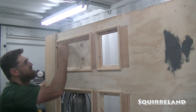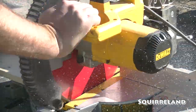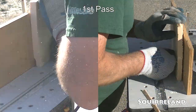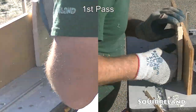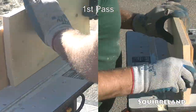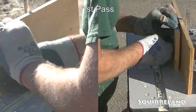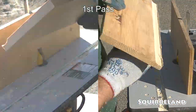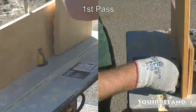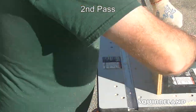With the last piece of plywood being marked, I can start working on the pieces of pine board that will make the next part of the design. These boards are 8 inches wide; however, here in America an 8 inch board is actually 7.5 inches across for some reason. This will leave me with about a 3/8 inch gap on either side when placed between the inner trim boards. The lengths of the boards have been measured to have the same 3/8 inch gap along the tops and bottoms as well. Once all of the boards were cut to length, I had to run them through my router table several times to get the desired depth of the cut. Although this router bit is brand new and sharp, it was still easier to do this particular cut in increments as opposed to all at once.